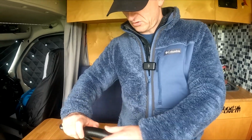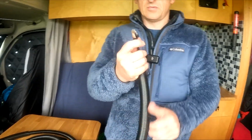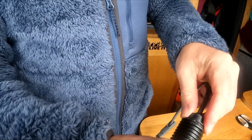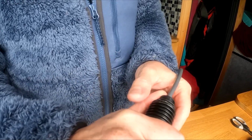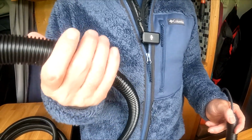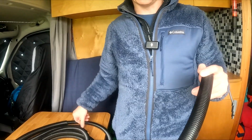So first thing I do, I run the cable through so it overlaps onto the other cable, and then we can seal this up. So just run it down like so. Plugs come out the other end. So I'm just going to drop that over the top. I'm going to slide that back to there and seal that part now, so that now becomes completely watertight and we'll end up with no water in the tube. And then the other end, where it overlays at this end, repeat the process and just seal that off, and then we've got a fully shielded cable from the weather.